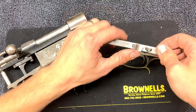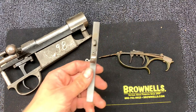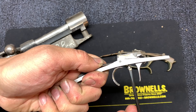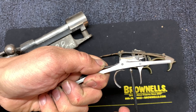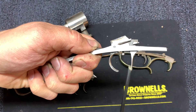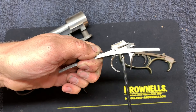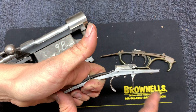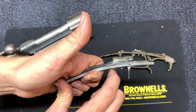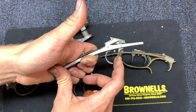The adjustment is done by this screw right here. Let me get a screwdriver and show you. As you screw this in, you're just adjusting the engagement surface. Tighten it in enough and it will trip the trigger — it tripped it there. To properly set one of these, go past the point where it trips, then back it out about a half a turn. That will give you a very light trigger pull — probably in the realm of about 8 or 9 ounces.